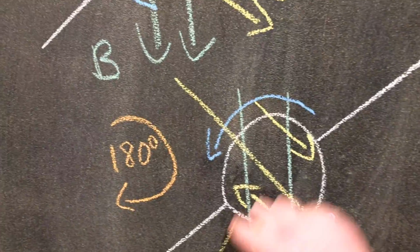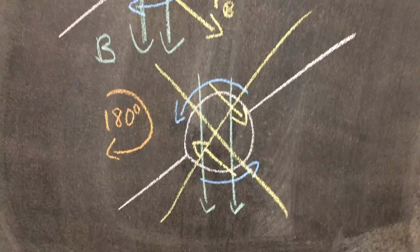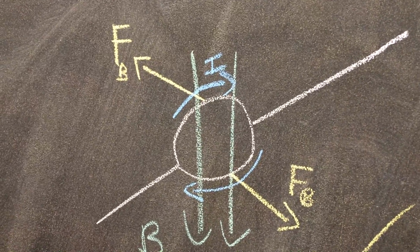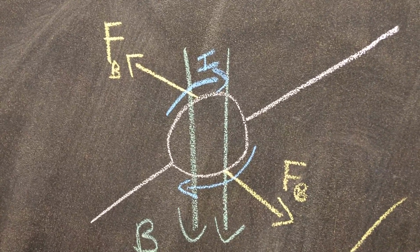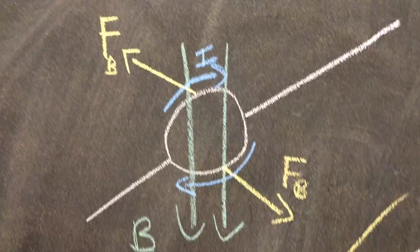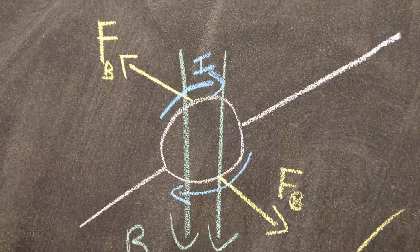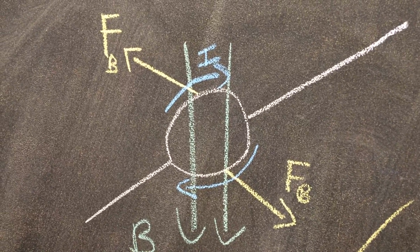By stripping off the insulation only on one side, basically we're saying that we're not going to have this situation at all, that we're not going to let current flow through at all. And that means we only have the magnetic force when the current is in this direction, and the thing's just turned off when it's in this direction. So that's why the motor that has half its insulation works.